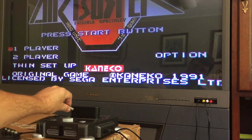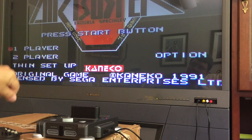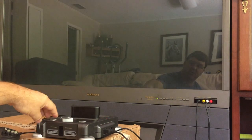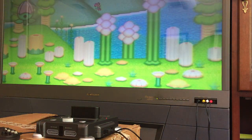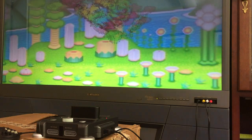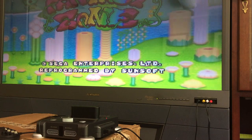I'm going to hold my magnet up here again. If you notice, the screen freezes, which is normal. What you have to do is turn it off and turn it back on to reset the processor. Sometimes hitting reset will work, but it's safer just to turn it off and back on, because sometimes pushing reset does not reset the sound processor.